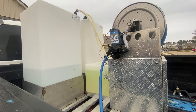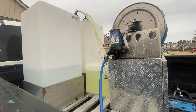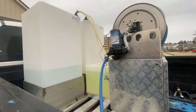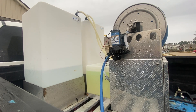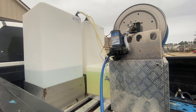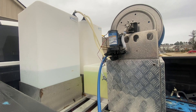You can put the bleach on either side — just don't get your mixing valves mixed up like I did. Also, you would not be able to power this off a water hose and do away with your H2O tank, because a water hose has positive pressure and that will recalibrate your mix ratio on the mixing valve. Use the softwash skid as designed for best results.